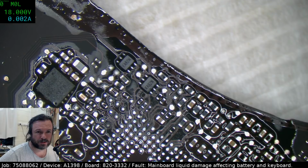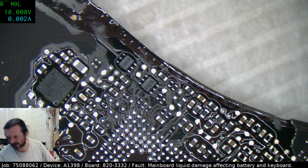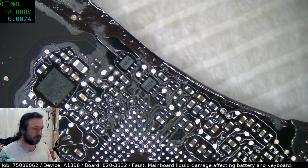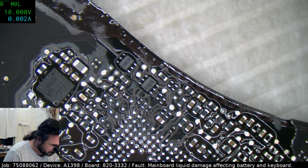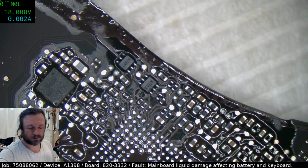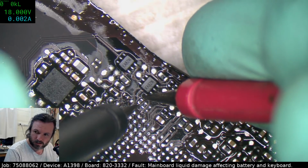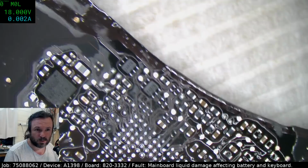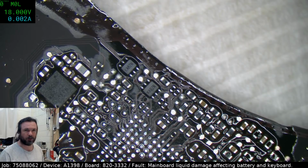I hope those two resistors are about the same value. I kind of flipped one around. 5092 is 100k, 5073 is 10k. Alright, that's going to at least be easy to spot if I've got them mixed up. 100k for 5092 is correct. Okay, so I got them the right way around.